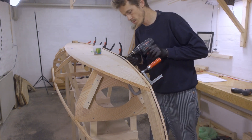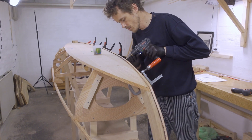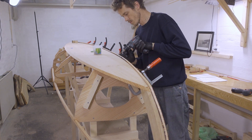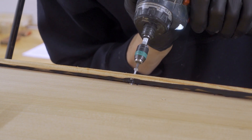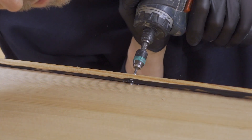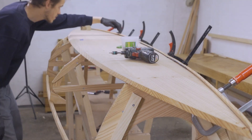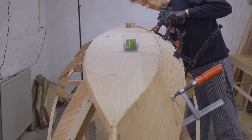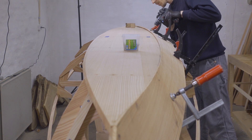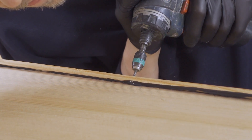Now the plank has been attached at both stems. Next up is fastening it to the bottom — the plank is not perfectly tight against the bottom between the frames and the bulkheads yet, and it's not possible to use clamps there. So to get it pulled tight I'm using some thin steel screws. These screws are temporary and will be removed once the caulk has cured. I'm drilling pilot holes through the waste part of the garboard plank and into the bottom, then driving in the screws just enough to pull the joint tight. I'm being careful not to over-tighten the screws because that might cause the joint to open up on the inside of the boat. If the plank moves when I push it I'll just add another screw. Don't be afraid to use a few extra screws — they may poke through the bottom panel but it'll be easy to repair these holes later.